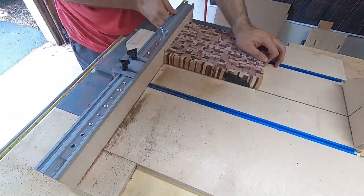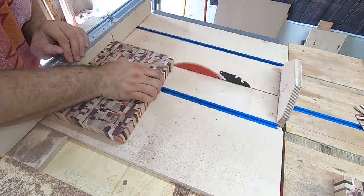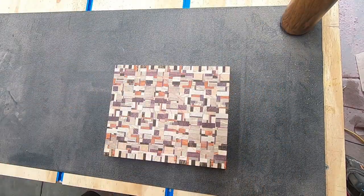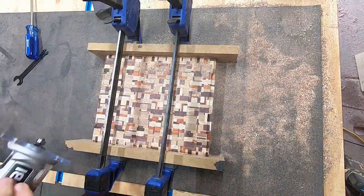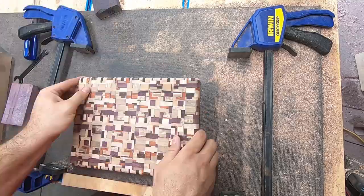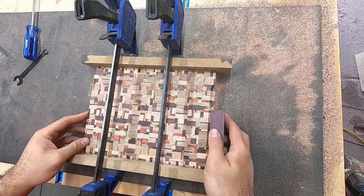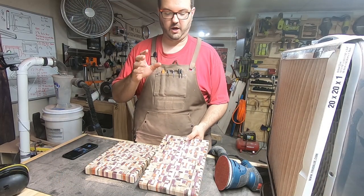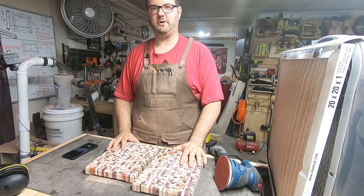Here I'm squaring off the boards to their final shape, taking my time to cut off the absolute minimum. Next, I round over the edges with a round-over bit and my palm router, taking several light passes to avoid burning anything. Since these boards are thicker than standard boards, I wanted to make them easier to pick up. I'm clamping on a couple pieces of MDF to act as a stop for my palm router, then I use a cove profile bit to carve in some finger holds. Once I screw in the rubber feet, the board is elevated enough that you can easily grip it by the finger holds. Now it's time for an epic sanding montage!